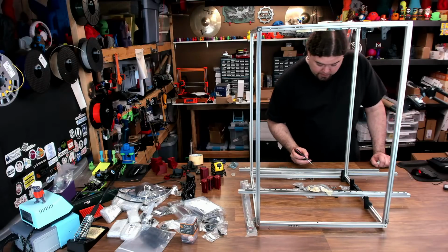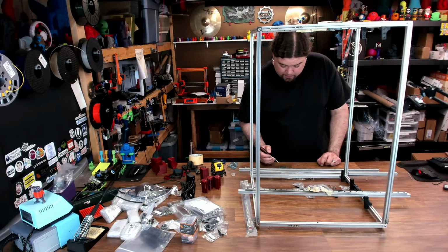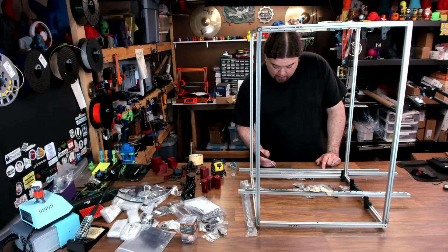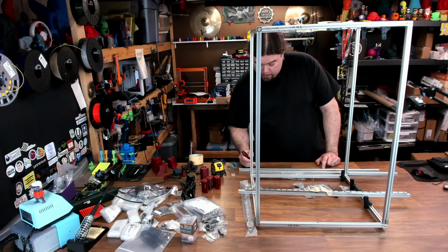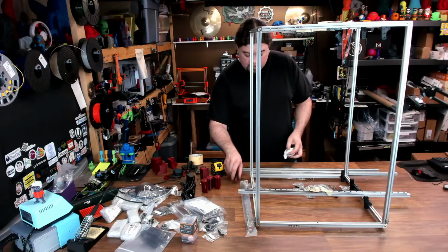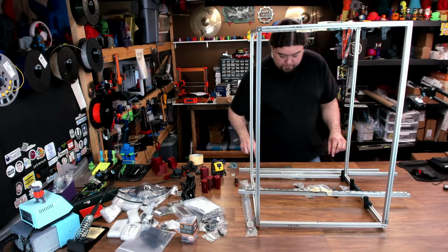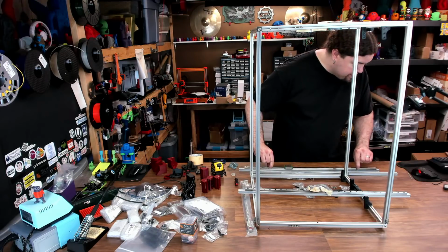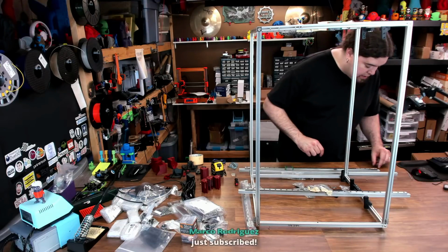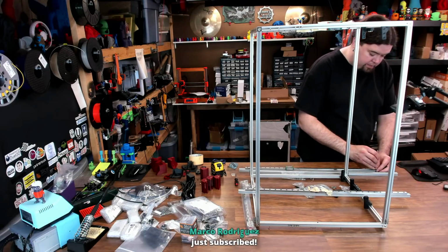VS Code with Platform IO can be a little misleading because they want you to start a project. And in that project, they try to make your life easier, which I think in turn makes your life harder, by telling you to select a default environment. And when you pull in Marlin, you have 100 different environments that you can use. The environment meaning the board. So it gets a little confusing. So what I like to do and what I show in that video is I just select the environment on the fly in Platform IO. I just think it makes a little more sense to me. Plus it gets you used to how Marlin does its configurations and such. Probably not the most helpful thing for the one-and-done user that just needs to get their printer going. But if you ever want to go back, that'll get you set up to make it work.